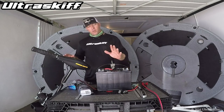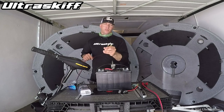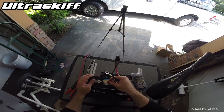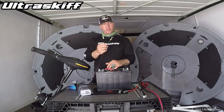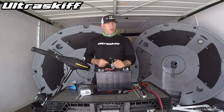So if you're not going with anything fancy, which we're going to talk about in a second, the best way to do it is to just use whatever connectors came with your motor. In this case, on this Minn Kota one, it's just these, and this creates a really strong connection as long as you tighten these nuts down really nice. It's healthy. Sand them off periodically every few weeks, get the corrosion off of them, and you really can't go wrong there.